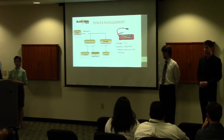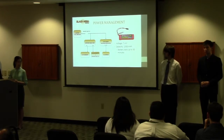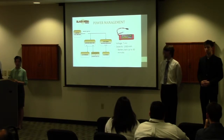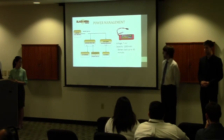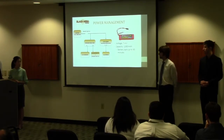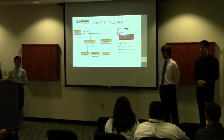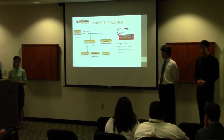For the power supply, we use a lithium polymer battery at 7.4 volts with a capacity of 1300 milliamp-hours. The Arduino is connected to the battery through an on/off switch. The voltage regulator inside the Arduino provides 5-volt output to the IR sensors and 3.3-volt output to the accelerometer. The servos operate at 4.8 to 6 volts but require more current, so we use a step-down voltage regulator providing 5-volt output at 3 amps — enough current to power the servos.